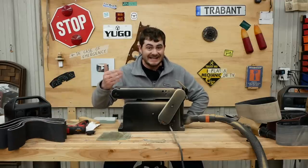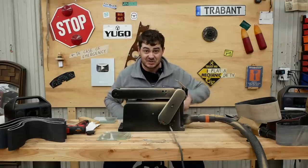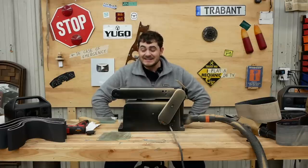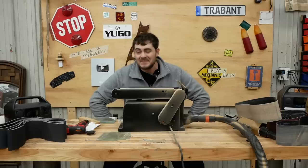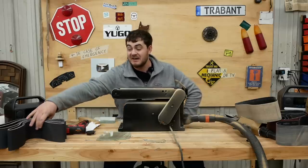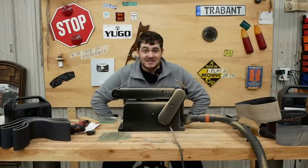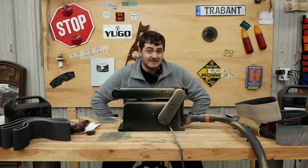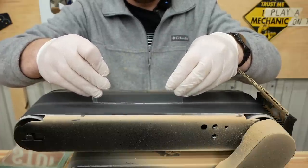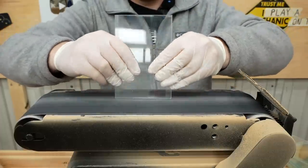The method I've chosen is a standard belt sander coupled with silicon carbide sanding belts that can effectively sand down the glass. It's dry, so it generates a lot of heat and glass dust — that's why I've added a cardboard scoop and 3D printed an adapter so I can hook up my dust extractor to suck up the maximum amount of glass dust. These sanding belts don't last all that long — I can get through about 24 pieces of glass before I need to replace the belt. I'll start at 120 grit for rough shaping, then 240 grit for final shaping and finishing. If possible, I left the factory edges of the glass completely untouched.